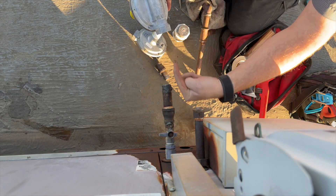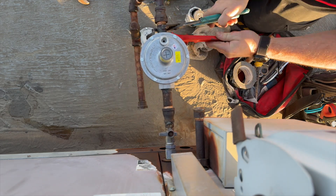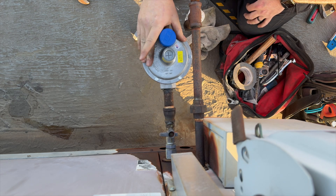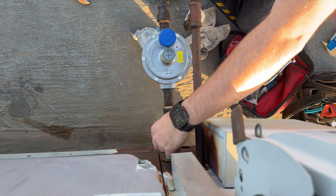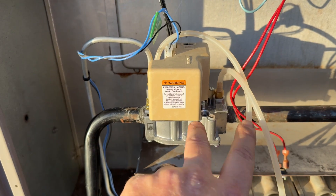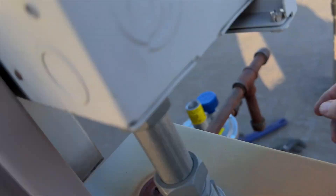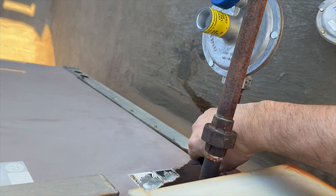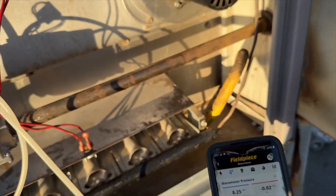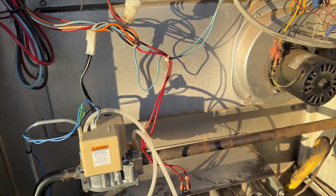Make sure you've got the arrow pointed the right way. Putting on our vent protector, and we'll leave this cap off because we need to set the gas pressure first. We're going to check for gas leaks — this is going to squirt out a little gas, that's normal. We got our manometers hooked up: this is our inlet, this is our outlet, and we want to start with the outlet. Currently we are at zero PSI because I have the gas off. Turning the gas on — we are at about 8.25. When it's running, it'll probably run around seven, so we don't need to adjust that. So we're going to go ahead and cycle the heat on this.